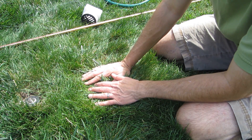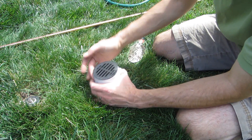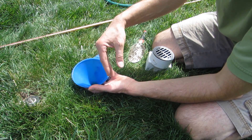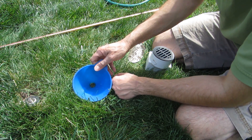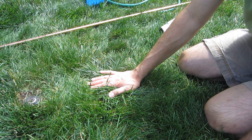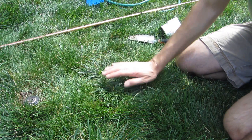If you're putting this under a tree or somewhere where there's no people running around, you don't have to do this — you can just put it flush to the surface. You may want to put a funnel around the top of it; it makes it easier to keep it wet and will catch some rainwater. Make sure you know if you have any underground utilities. It's very important to know where all that is before you start digging. Even though this is only going to be a shallow hole, you still want to know where things are.